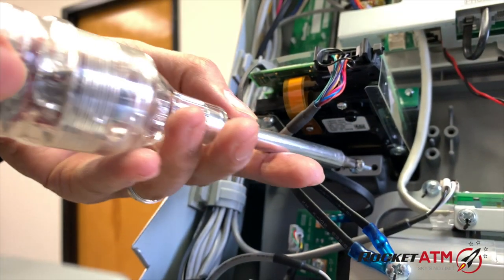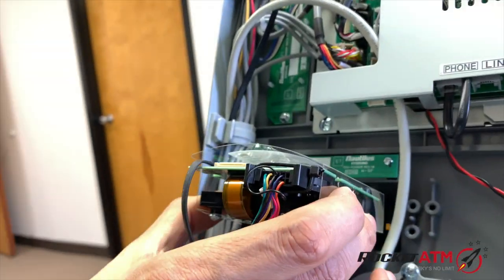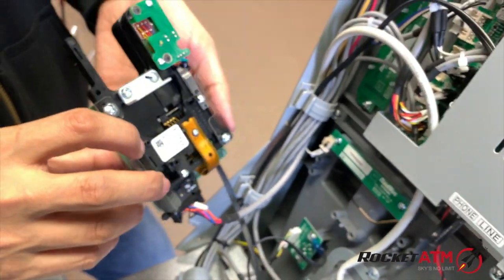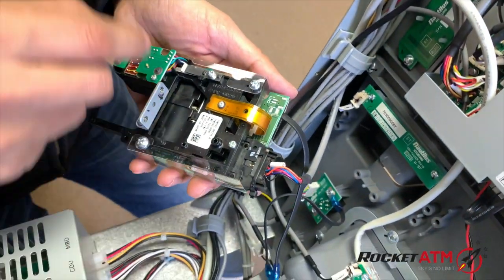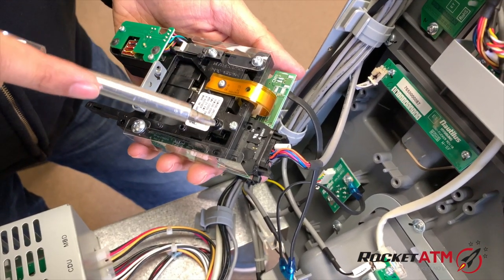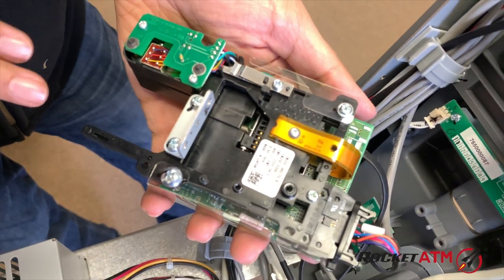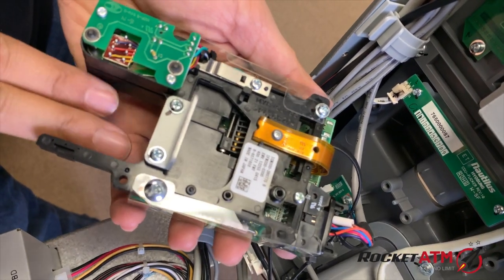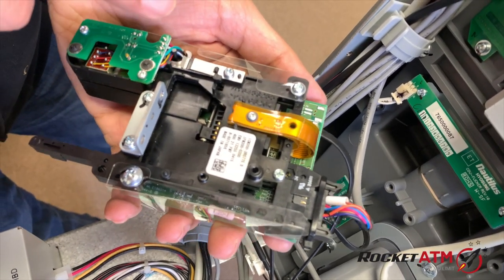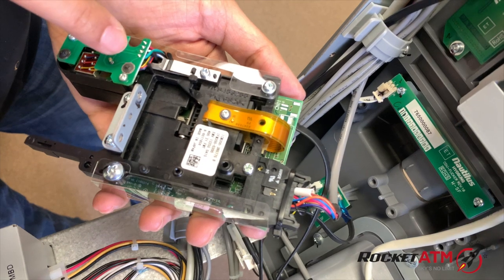Okay, after removing the second screw, this card reader now, you slide it out and of course the power's off. You can now get it in your hand, flip it around, and explore to see if you can see any sort of junk caught up in the back, which is where I suspect the problem potentially is, because again, customers often insert their credit card from the front and jam up stuff, and credit cards come with those little stickers on them to activate your credit card, and sometimes people just leave them on. But whatever the case may be, you want to explore this in greater detail.